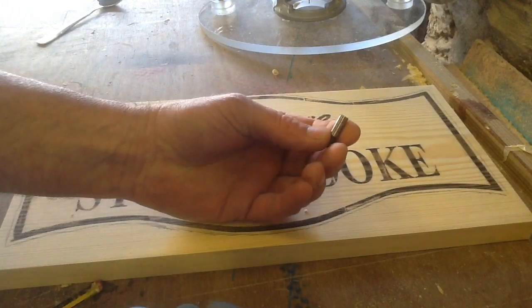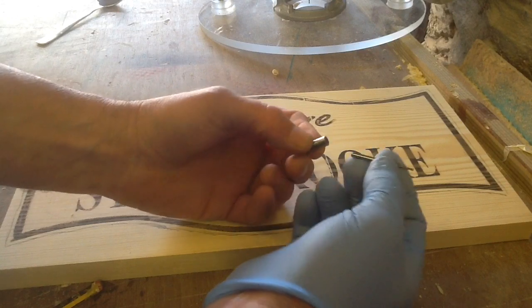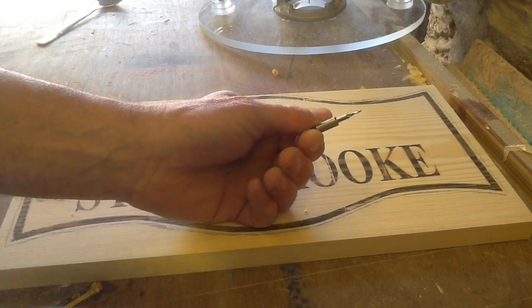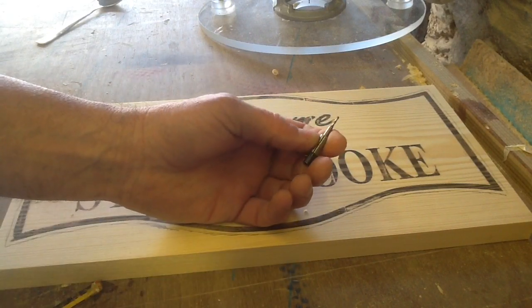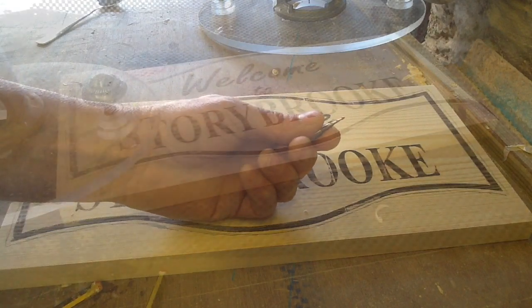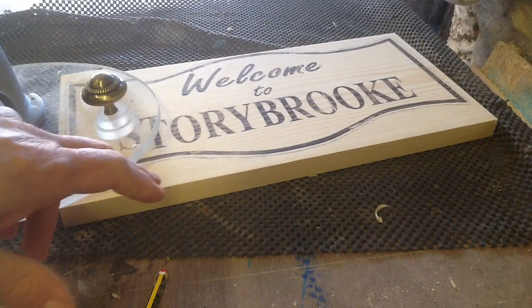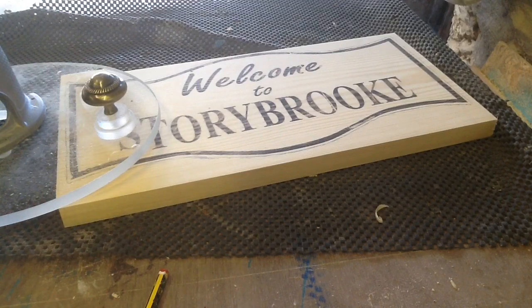You have a 1/4 inch router, you have a 1/4 to 1/8 collet reducer, you have the bit, it goes in like that. These are commonly referred to as CNC bits. They're not specifically CNC. You don't need a special type of machine for them, they're just a bit small. They work just the same. Okay, got hearing protection on, eye protection on. I'm going to just do the first couple letters, and then I'm going to put it on high speed.